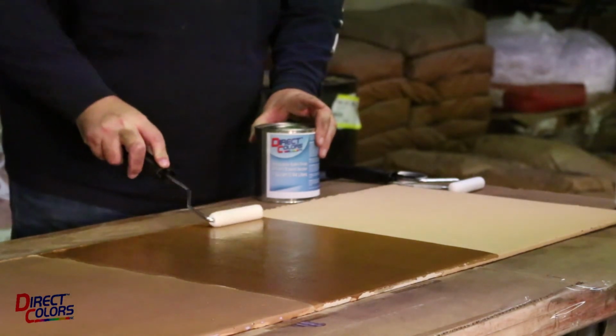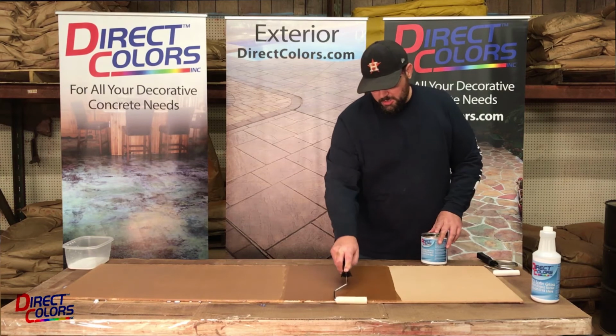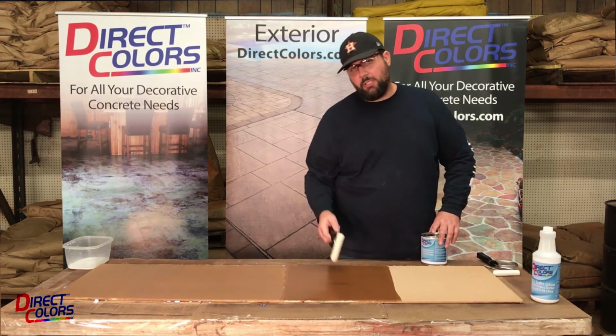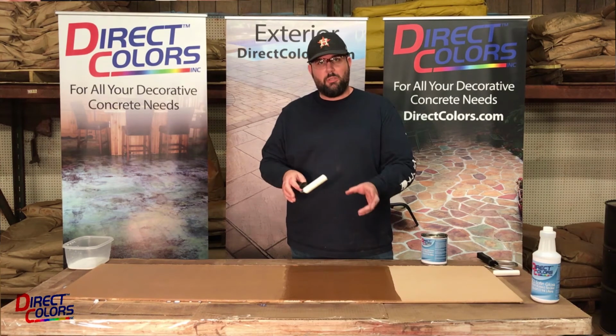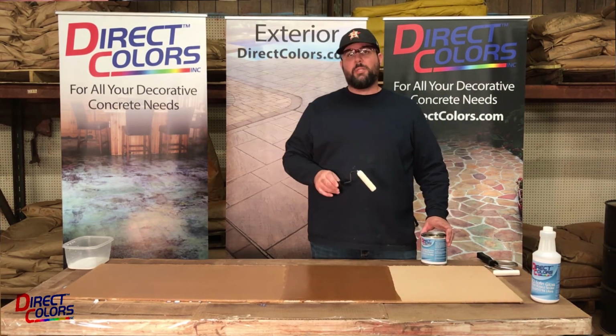This sealer is very forgiving to work with. If you do get some blemishes or something in the finish that you don't like on your first coat, typically you could come back with your second coat and it will emulsify that first coat just enough to fix some of the mistakes or the blemishes or whatever. So a lot of forgiveness in working with this. Makes it super DIY friendly.